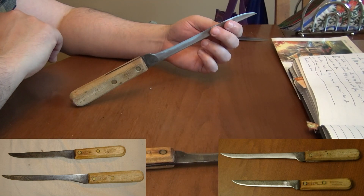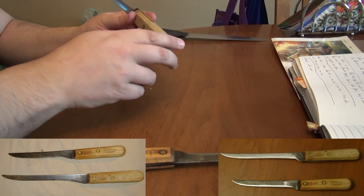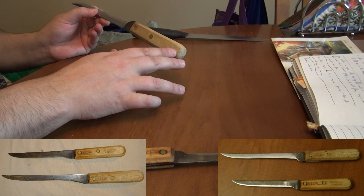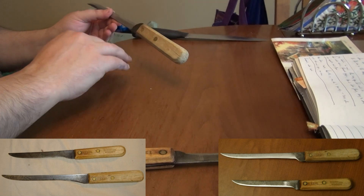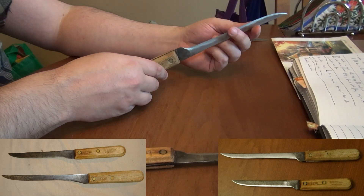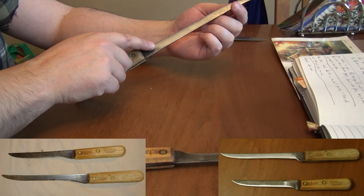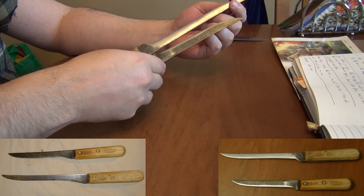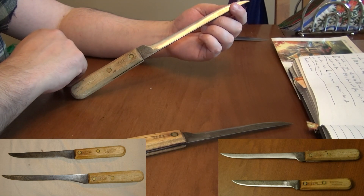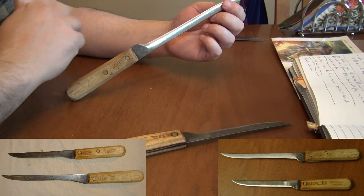This is another one owned by the same individual. These are both made by Dexter Russell, I believe - there's a Dexter stamp on them. This handle also has some splitting on both sides but it hasn't cracked all the way through. You can normally do a very thin syringe epoxy injection into this which normally works, but I didn't think this was bad enough so I just did a light sanding and a coat of linseed oil. Unfortunately when I ground the edge bevel on this one the knife was actually so thick - you can see how much thinner the blade is - that the edge bevels moved up into steel that was absolutely so thick it wasn't much of a knife anymore. And the blade is so narrow that it's a shame to have that there because the potential is there.